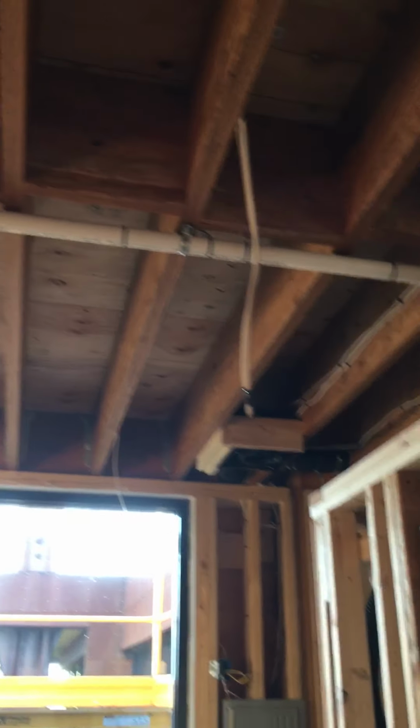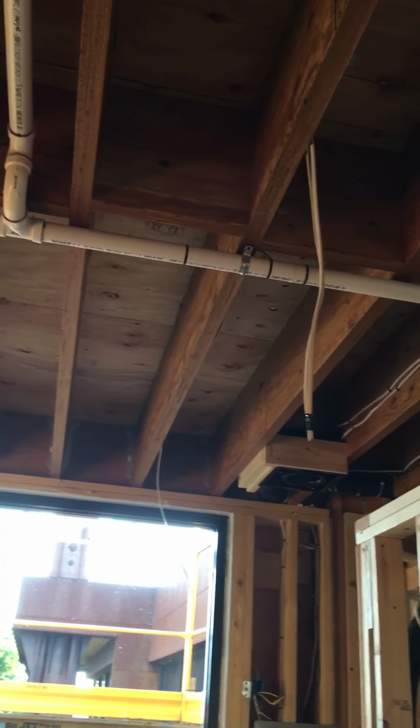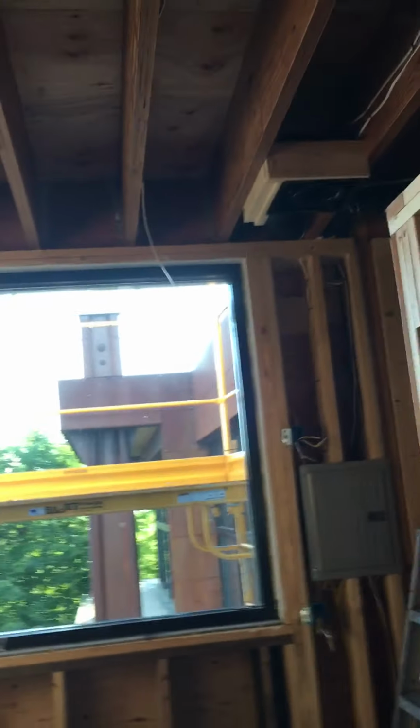You can see how it's going. We're going to put a foil radiant barrier up there, and then we strap it after that, with 2x4s and regular 3/4 inch strapping to come and meet with this double plate up here. And then when our T comes in, it comes across flush and finishes the window trim.